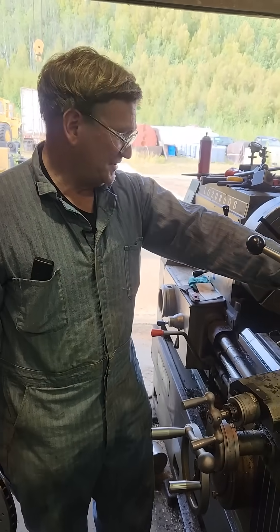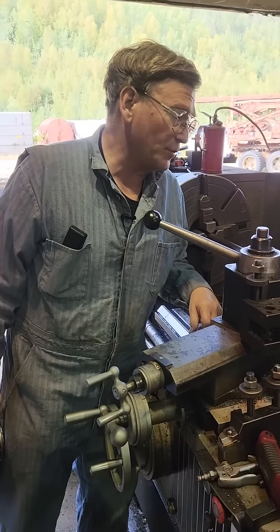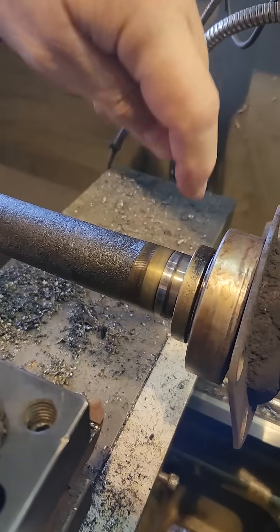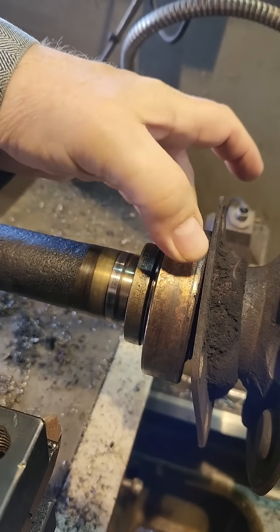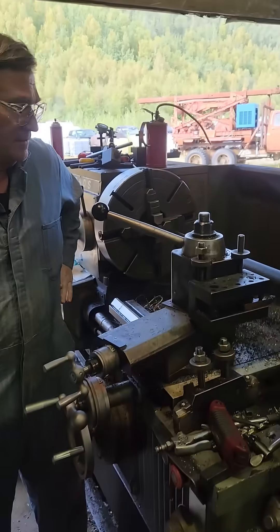An axle that's straight, this stuff here will still wobble all over the place — it's just rough forged. You also have a surface here that you can use where your bearing is. You could, if you needed, put a steady rest on that bearing if the bearing's good and runnable.